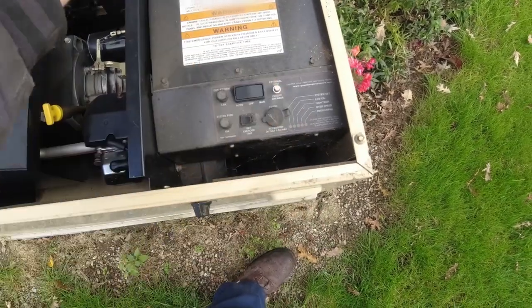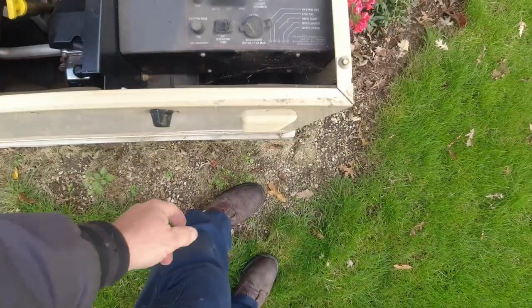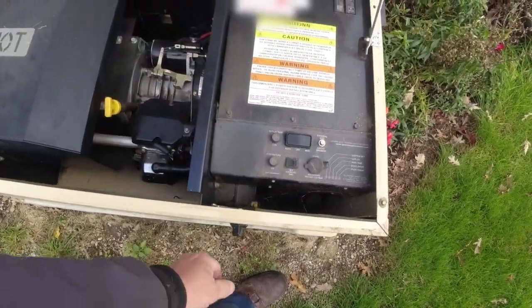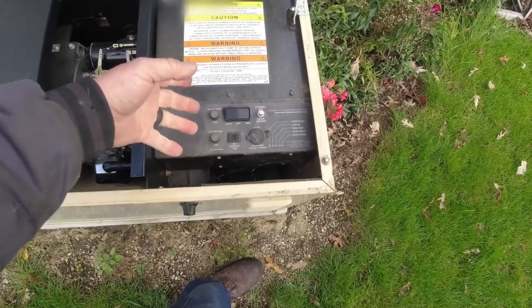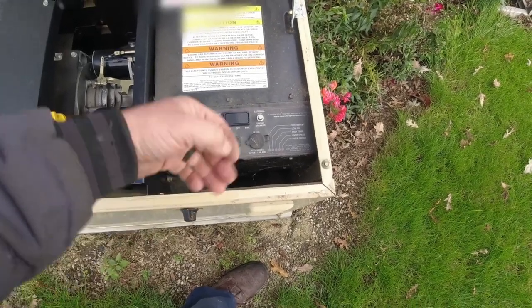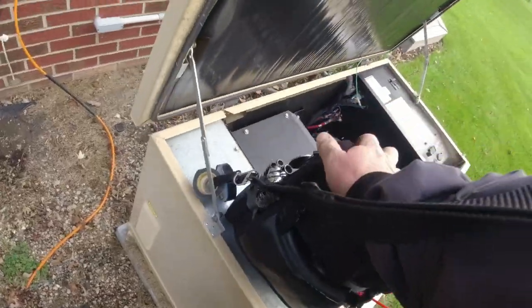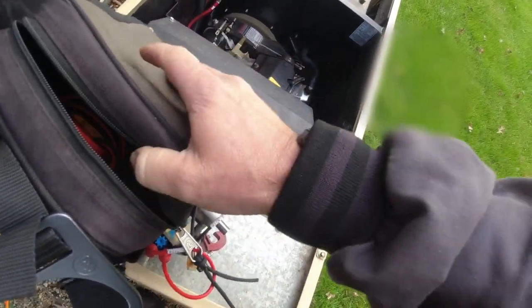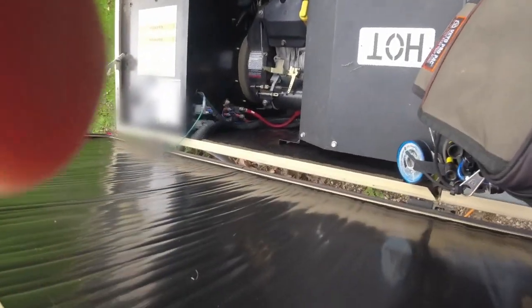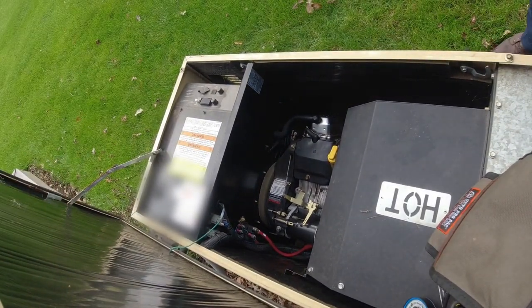More times than not, oh, I can tell you right now what's wrong. Yep. Battery exploded. That was another humongous problem that Generac had. They had a very, very aggressive battery charger, and it would overcharge the batteries and eventually bake out the water, and then they explode. This is not the first time I've seen this. This is why I tell everyone, change your battery every 4 years. That seems a little extreme, but you bought a generator to have it there when you need it to work.